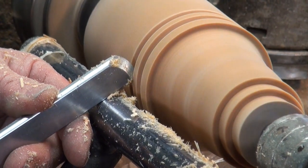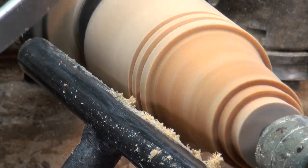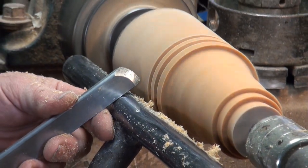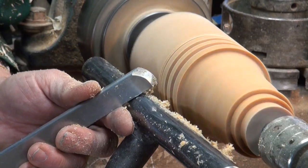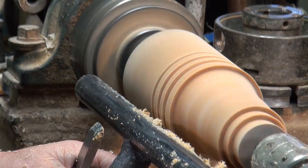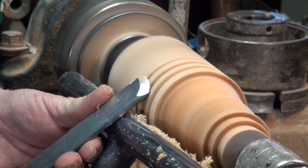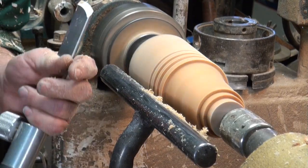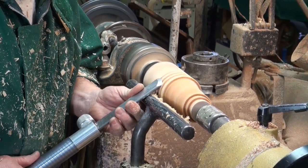Probably one of the more difficult things to do with a skew is to roll a bead. I probably should have warmed up, but I'm going to use this side of the skew for that — it has a radius in it rather than being flat. The flat side is made for these cuts and keeps the tool flat on the tool rest. Now we're going to try to roll a bead. I'm going to raise the tool rest a little bit and roll one going that way towards the camera. My thumb is going to do most of this work. I use my thumb a lot when doing spindle work — I have a finger hooked underneath the tool rest and my thumb does the work.